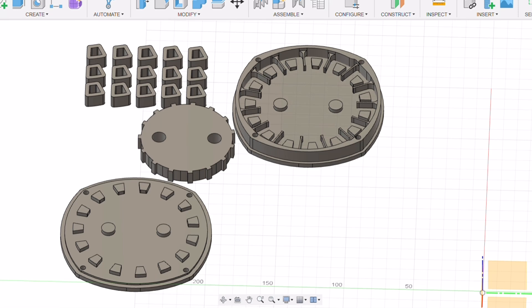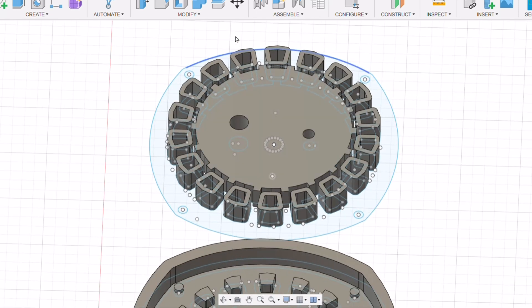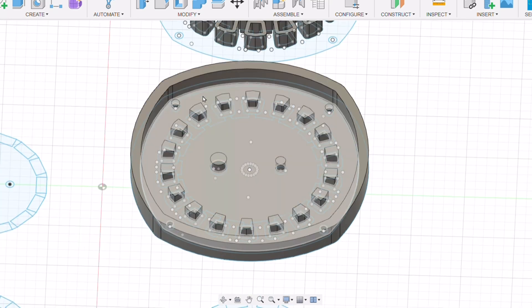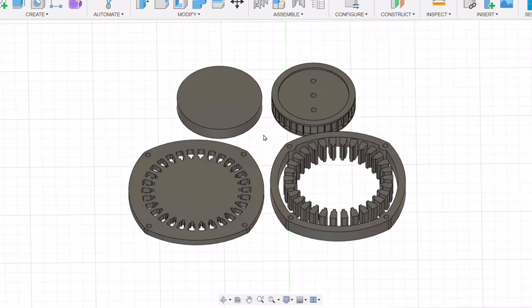I also designed an 18-slot stator which is easier to show - you can see the center piece and each individual piece. After making the 15-slot stator, I decided to go without the rebar on this one, as it would probably be strong enough - just the outside surround with the rest fitting the same way. I also designed stators with more slots, because more slots means less cogging. Since this is a robotic actuator, even with a gearbox attached, the smaller the incremental movement the better.